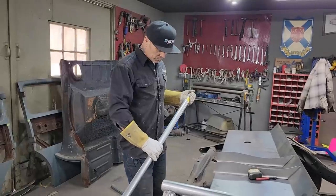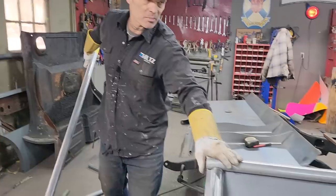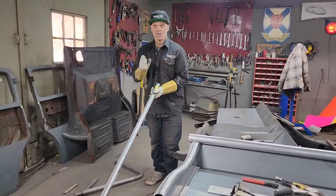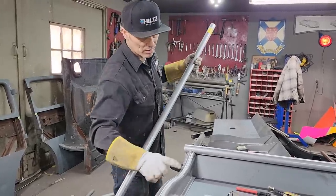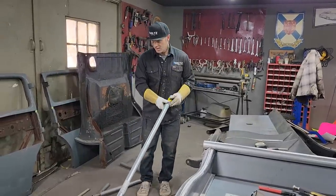So what I'm going to do is find the line, just like I welded the exhaust pipe on the top of this piece. I'm going to find a line. I'm going to zip cut it down, or cut a piece off. We'll zip cut it in half. Then I'll have two shapes of the exhaust pipe. Hopefully I can bend them to this shape without making it all distorted and that sort of stuff.